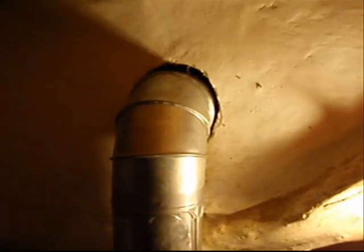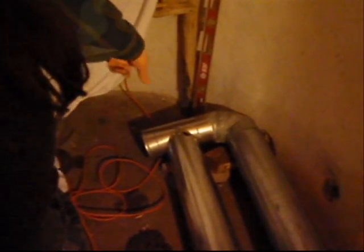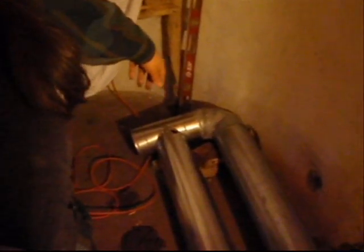Send it down on the inside of that barrel to this joint here. It's going to go down the pipe, return back up to the smokestack, out that wall where we drilled that hole. And what's this little bit of freakiness at the end there? That is a clean-out. We used a T-joint with a cap so you can pull that off — probably every time somebody lights a whole bunch of newspaper and it gets stuffed in there, or once every five or ten years, depending on how well you run the stove.